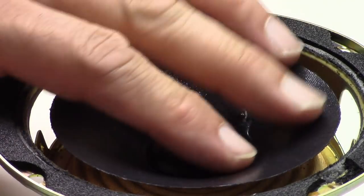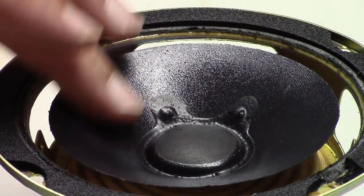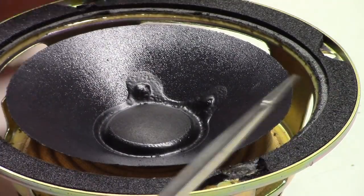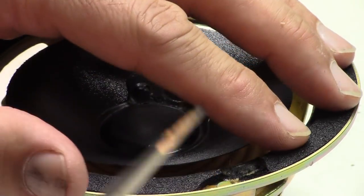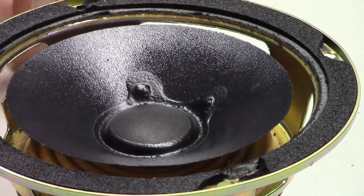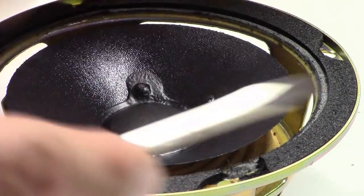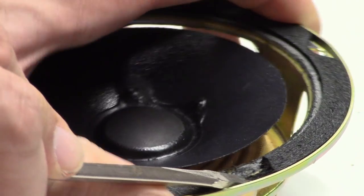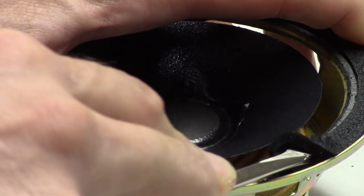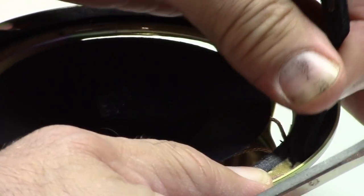The cone is now pretty well cleaned off with a nice clean edge. Next, I need to take off the surround gasket area. If you have a heat gun, you can heat it to help pull it off — but most of you probably don't, so I'll show you how to deal with it using a small flat blade screwdriver. Just be careful not to put the screwdriver through your hand. Most of these glues are low-strength, heat-sensitive glue and not too bad to get off.